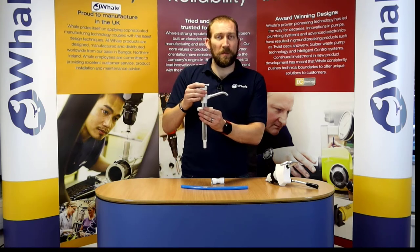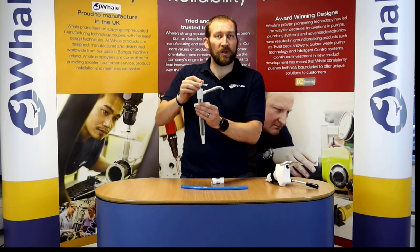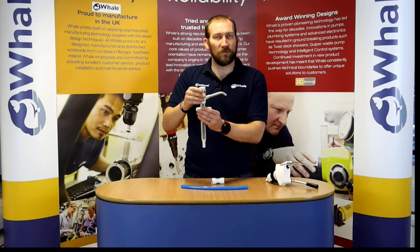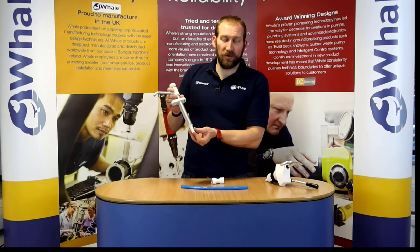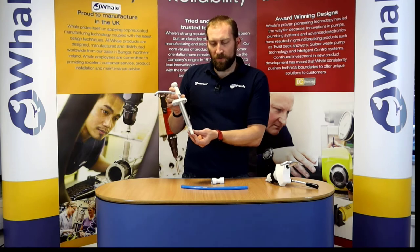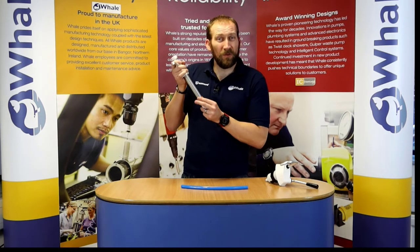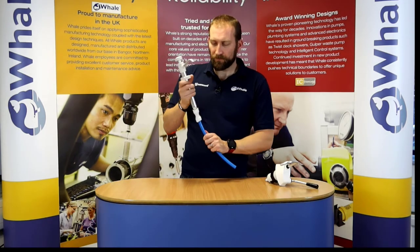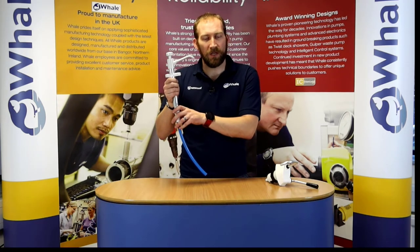In order to prime and pump this little V pump you just lift the handle, pump up and down a couple of times, you start to feel some restriction in there and then the water will start to flow. In order to plumb this into your system you can use flexible pipework, or if you wish you can use the Whale WX plumbing system — that way you don't have to use any pipe clamps and there's less likelihood of any leaks. Just take the supply from your fresh water tank and you'll have fresh water at your sink.